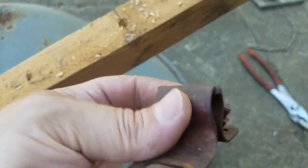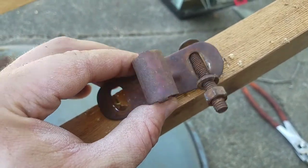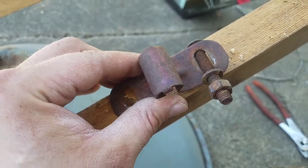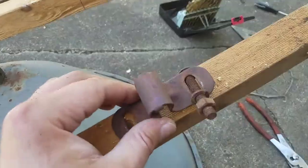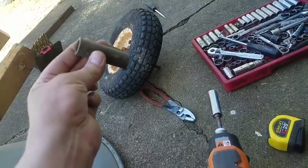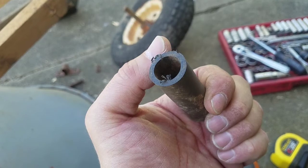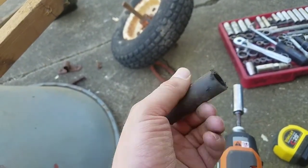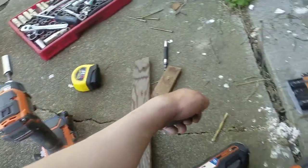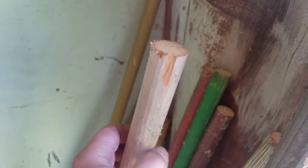We're gonna mount these the correct direction - this is a stopper for the axle and they are adjustable. You're gonna need to adjust this side to side and try to square it up for a straight line down the center. One thing I forgot to mention is there are these axle spacers - they slide on the axle and they keep the wheel as close to center line as possible. I lost one of them. I need to find something that is pipe-like, or I can take a handle and drill a hole down the center of it and make one.